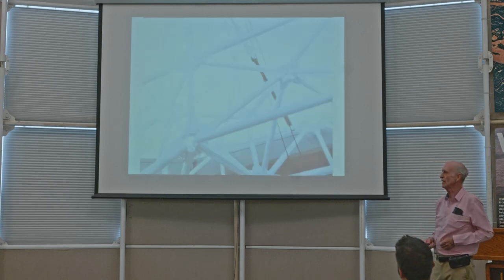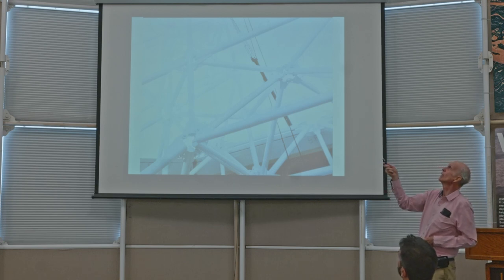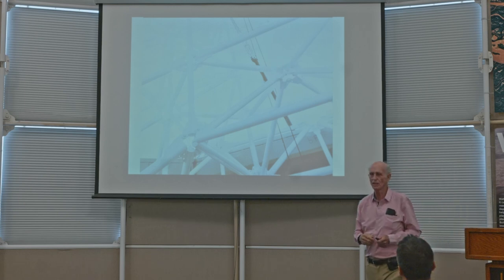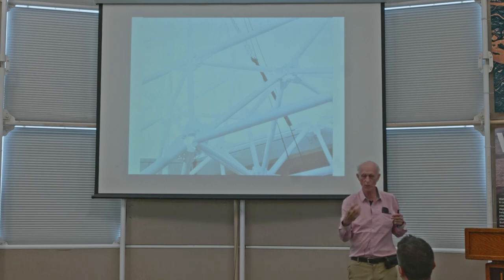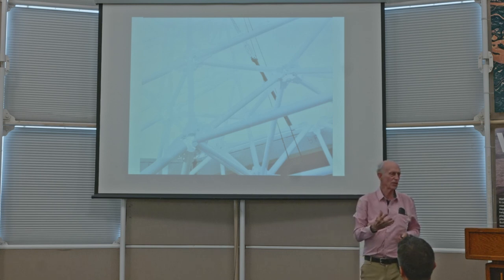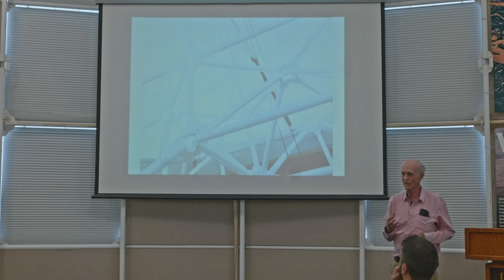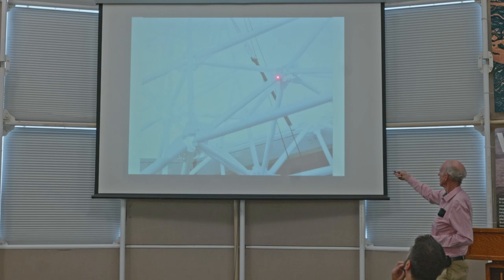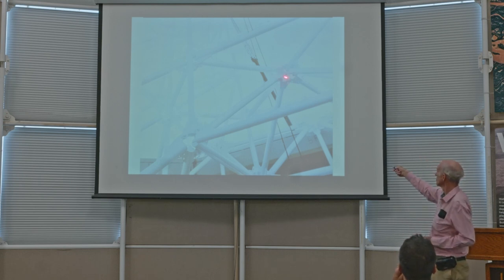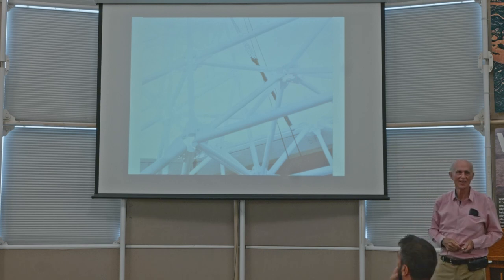And then the space frame, which you see around, like here, well, that's not a good example, but the space frame, this was Peter Pierce's invention, is that you have the nodeless node, where all the struts converge to a point. Typically, what's been done in geodesic domes and space frames is you have a node, and you connect every strut to the node. Well, you get a lot of stress concentration by doing that, and it's a difficult thing. His invention was that you put these little ears on the ends of the struts that connect to each other. So you see there's a hollow space in the middle. Nodeless node. Next slide.